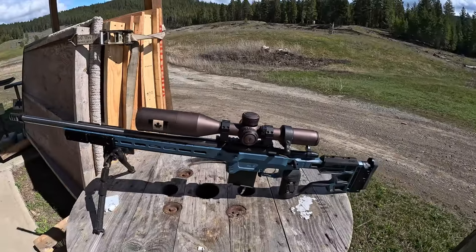I'm just going to aim at the center of my target. Okay, here we go - first shot with the new action with a barrel that wasn't machined for it. They say that the headspace will be the same from action to action with the TL3 Zermatt Arms Bighorn action. I don't think I hit the target, but I should have bore-sighted first. I just wanted to make sure she was not going to blow up in my face - and she's all good. So if you're looking for a good action that has the same tenon from barrel to barrel, the Bighorn TL3 - I just proved on the .223 barrel that it is true and it's good.